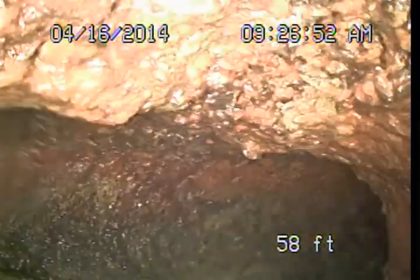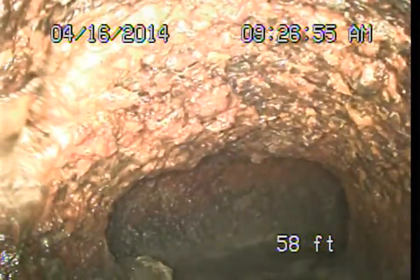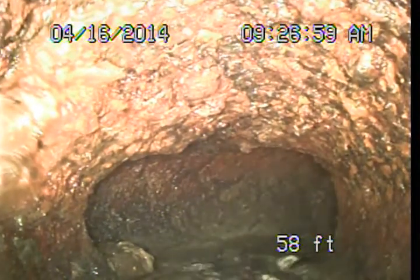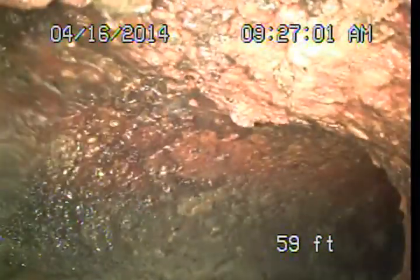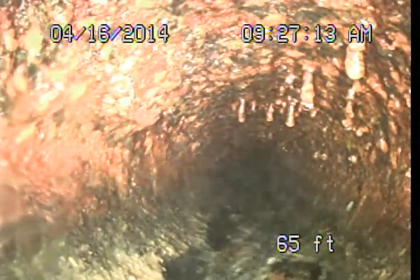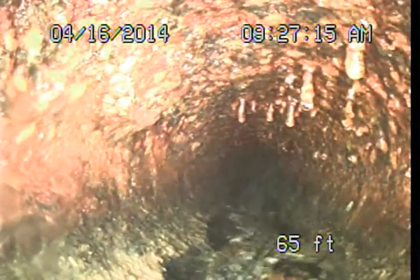Now, these cast iron pipes typically were expected to last somewhere in the 70 to 80-year range. So, seeing as most of it's been upgraded underneath the house, it's reasonable to suggest that the 20 feet or so of piping left in service from just under the building out to the middle of the planter here is ready for upgrade. It's some heavy to excessive rust and scale buildup.